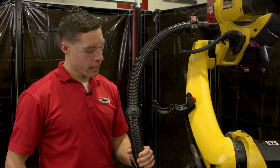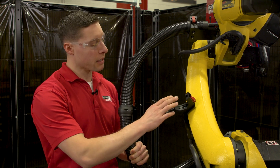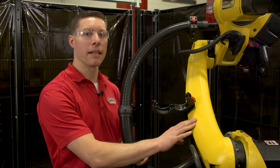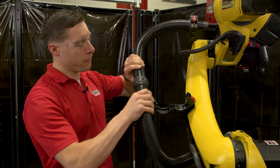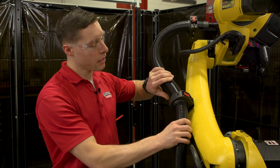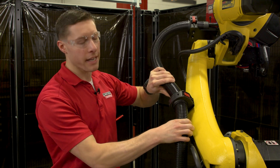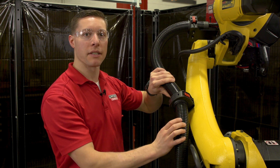The dress pack includes a ball joint and a clamp style system. The clamp attaches to the robot using the factory recommended accessory bolt holes. The ball joint fits into the clamp and you simply clip it closed and then secure with the locking tab. The conduit can move around inside of the clamp to increase the lifespan of the conduit as well as the cables inside.